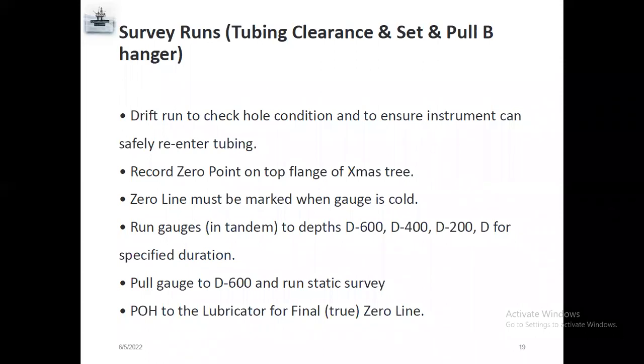They will call it, the well diagram depth is RTKB, and the second one, wireline length, is WEZ. So, for example, for a 7,500 R nipple depth as per the well diagram, the real wireline length depth is 7,470, which means we need to deduct 30 feet from the RTKB depth. So once you reach 7,470, you can set the gauges. If you follow the well diagram 7,500, maybe it will stop before that.